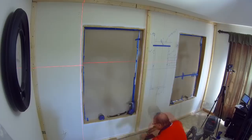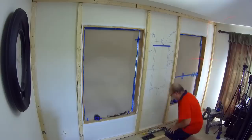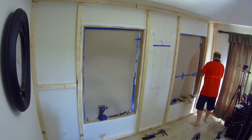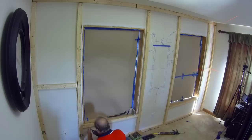When I run the wires — you'll see in a minute — I put the electrical outlet in for the fireplace, run it down, and connect it into the existing outlet without opening up the wall at all. All I have to do is run the wire in the new false wall and it's perfectly suited. One thing I'd like to note: these two by threes need to be glued and screwed to the wall, and the screws need to penetrate into existing framing as much as possible, because we're going to be hanging a hundred pounds of sheetrock on that framing.